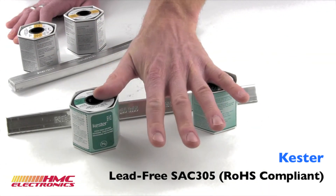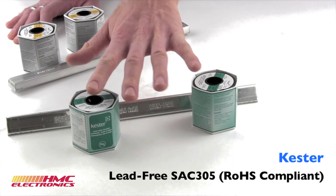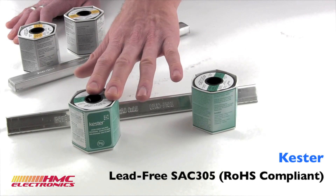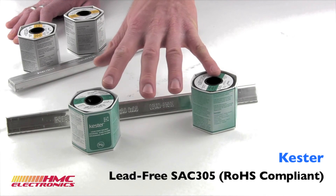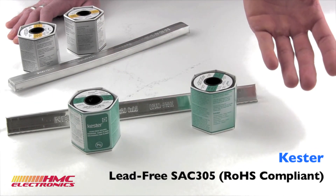However, it is different in its alloy, so it's also a little different to work with. You're going to see that a lead-free solder — the actual alloy, not the flux — is actually more aggressive on your soldering tips. So if you move from a leaded application to a lead-free application, you're going to see your tip life go down. But that's the price for RoHS compliance.